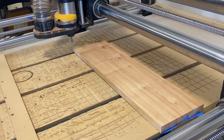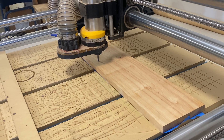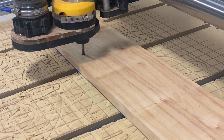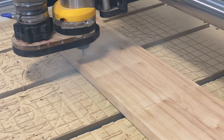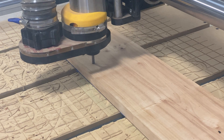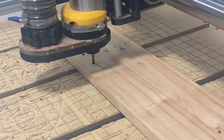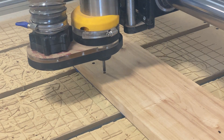What are my thoughts on using your CNC in place of a drill press and Forstner bits? It can actually be very handy because you can perfectly space out your holes by creating a CNC project. You also don't have to have specific size bits because you can easily use your CNC and make the diameter of those holes any size that you like. You will want to make sure that if you're making, for example, a quarter-inch hole using a quarter-inch bit, that it's an upcut bit — if it's a downcut bit, it pushes the material down into the pocket with no place to escape, so it basically catches on fire. Always make sure to use an upcut bit if you're using your CNC as a drill press.